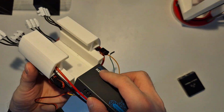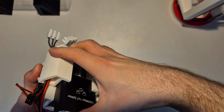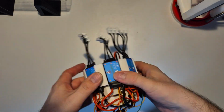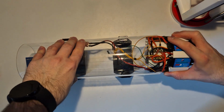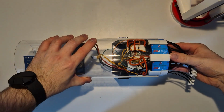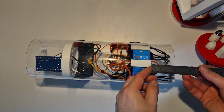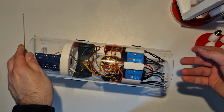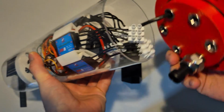It's impossible. And in order to be able to stream to multiple receivers, you have to use what is called, I believe, a broadcasting IP address. So this means that when you send a packet, it goes net wide. Effectively, this thing is DDoSing the Arduino. So Arduino is doing almost nothing but exclusively discarding useless packets that it gets from this thing.